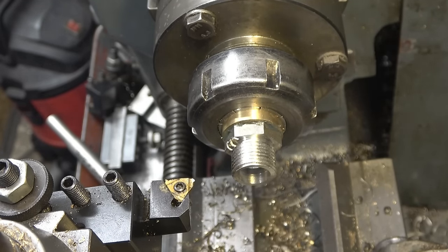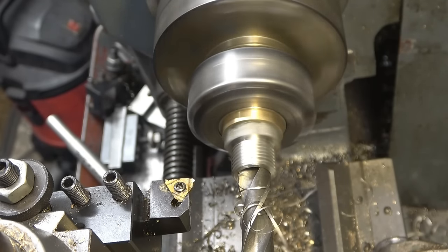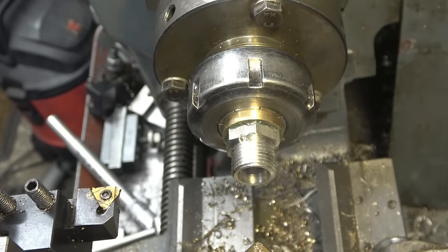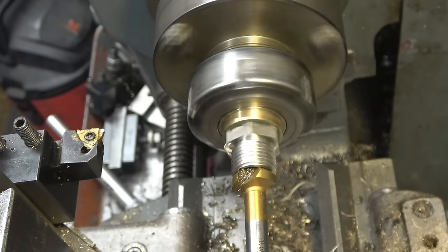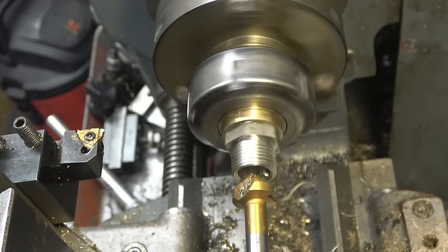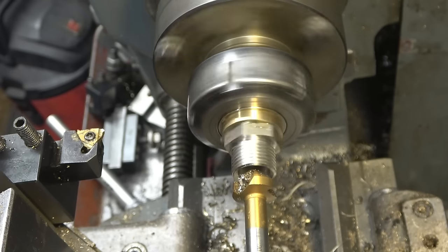Kind of a standard Conex fitting on the end of it, 15 mil copper pipe I think he's using, a little bit deeper. That's it. Then a chamfer on the outside end. Should do the job quite nicely, for the olive to sit into. Looks good.